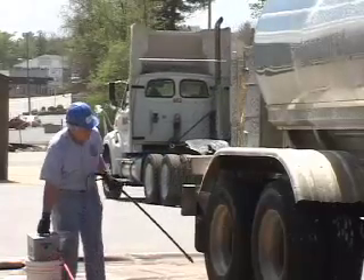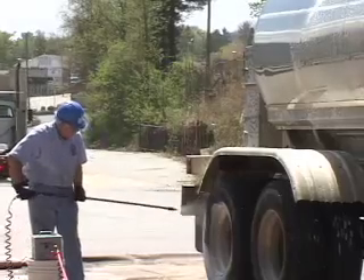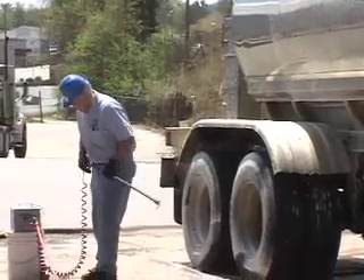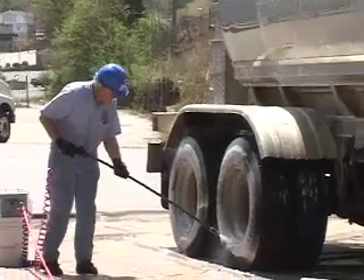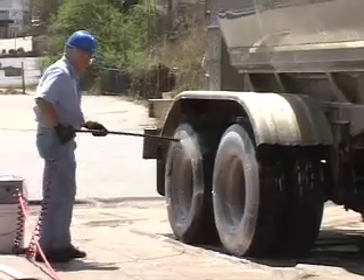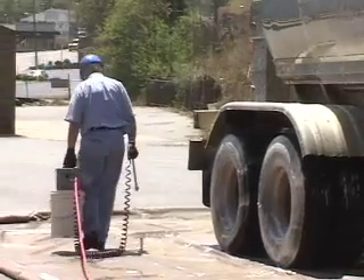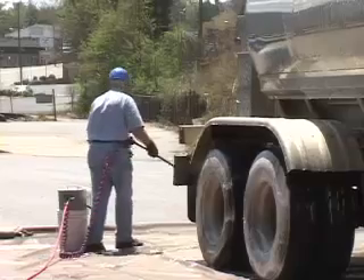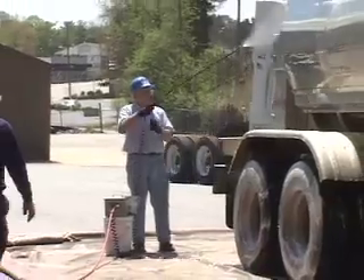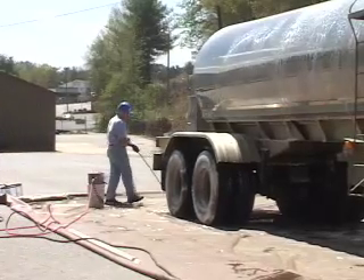Notice the tanker has already been washed at this time, but there's no water or wash water on the pad. As it drains down to the bottom left-hand corner of the picture, it's picked up by a sump pump and pumped to a 300-gallon holding tank. It took about 150 gallons of water to complete this entire operation. Of that, we picked up about 125 gallons of waste water — 25 gallons was lost to evaporation. On hot summer days in Texas above 100 degrees, you can have a 50% loss due to evaporation.